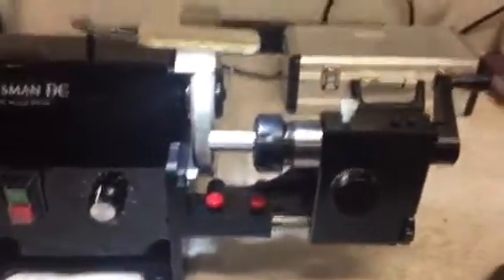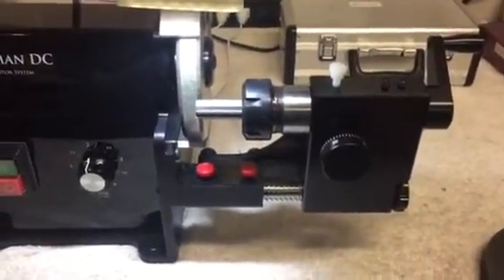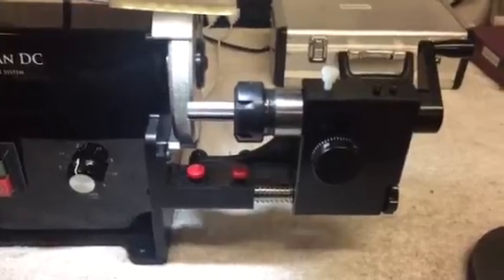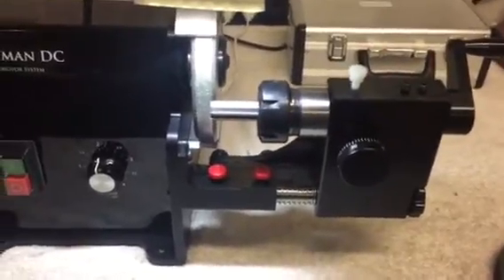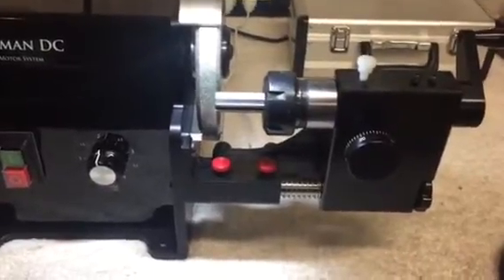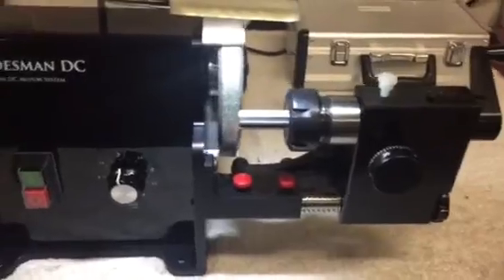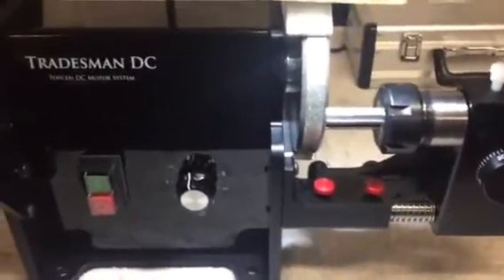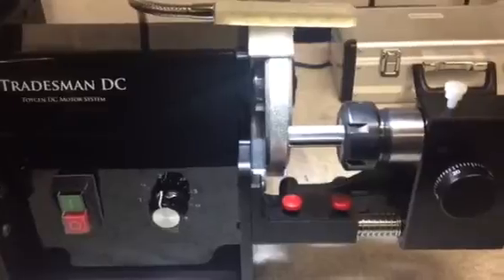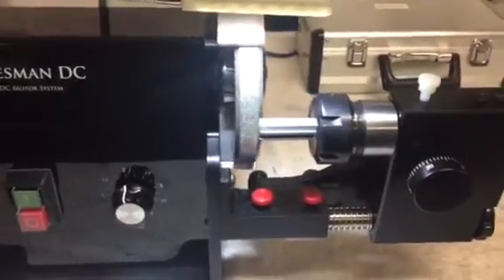It's pretty slick and they will all be the same — very straightforward. You can also do the same thing with the corner radius on an end mill with a little bit of hand work on the secondary clearance, and it will give you a nice shape on the end of a tool. You can do this for end mills also — if you don't want sharp corners with your carbide end mills, you can dress those corners off with this. So we're now doing carbide cutoff, neck reduction, Weldon flats, and reamer sharpening.